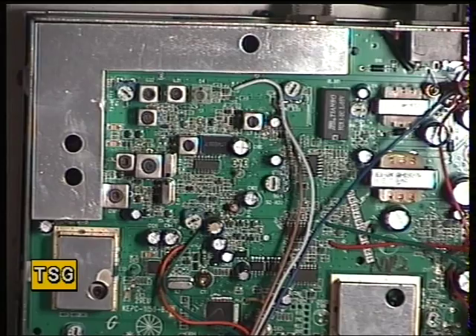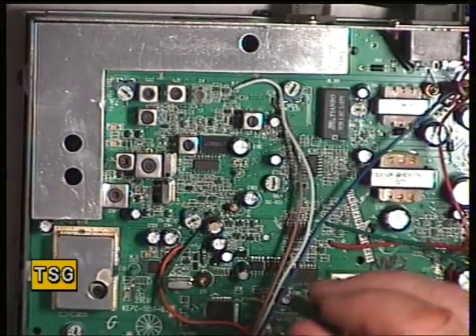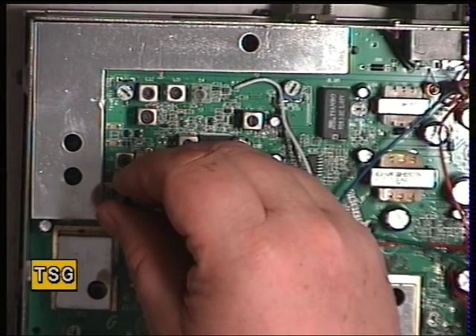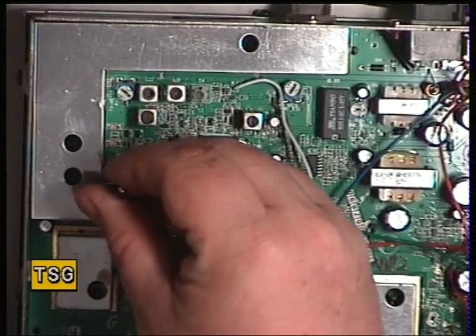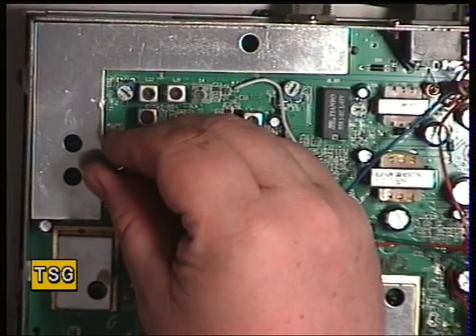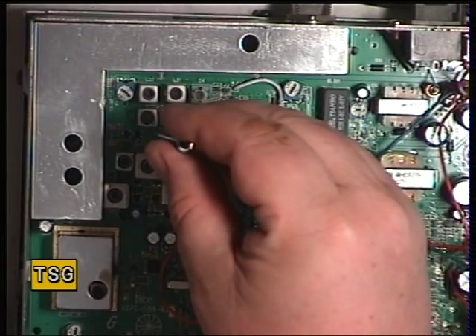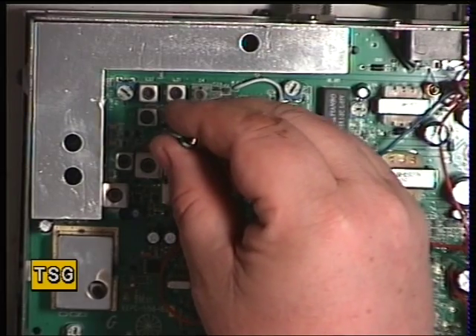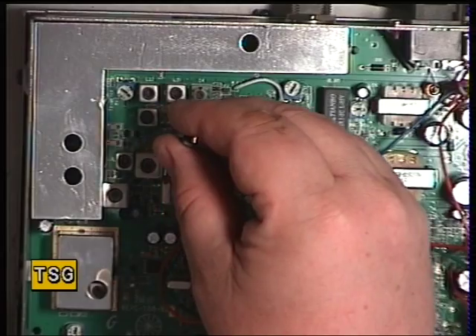So that's 27.79125 MHz. We'll make the first adjustment — presumably it's the one I can't find a label for. Being very careful with this on a new set — it is our property, just in case you think we're experimenting on our customers.